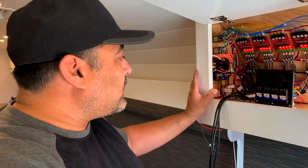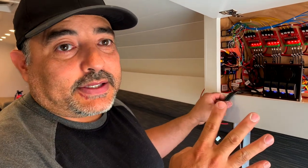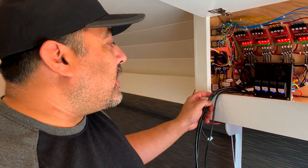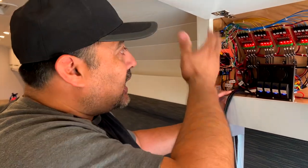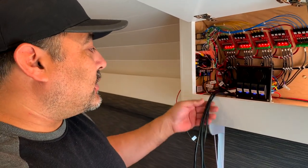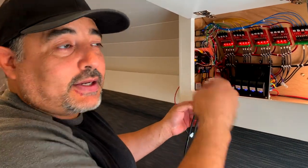of these little connectors. We also have other cables here because we have four wall plates that we're dealing with, and so they each have one of these network cables going to them. But for these, there is already a pull down resistor built into the processor that we can just call, so we're going to go ahead and leverage that. So these should just be a crimp on deal that we just kind of plug into the back.